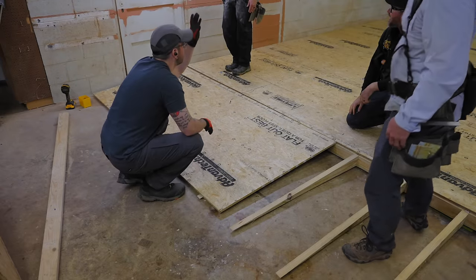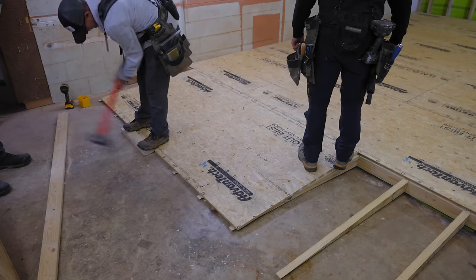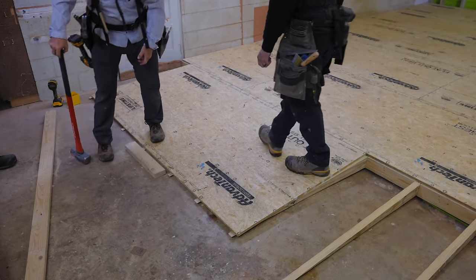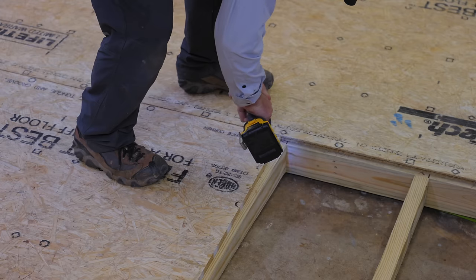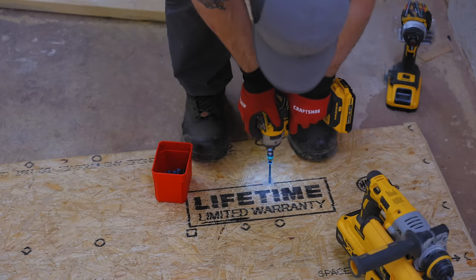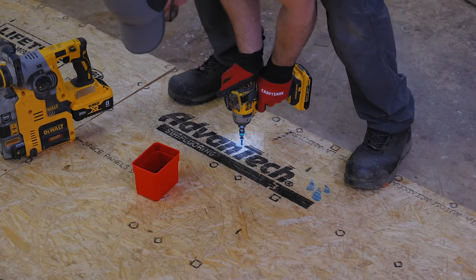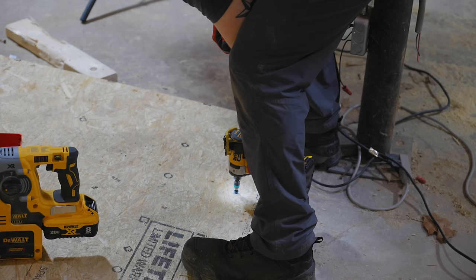We tested the transition between the ramp and platform panels and the tongue and groove seated fine with the panel angled, giving a super smooth transition. I decided to forego subfloor adhesive and use screws on the ramp panels in case I ever need to change things up. I attached the bottom edge to the slab using concrete anchors — though I ran out and could only install them roughly every three feet — and with that the platform and ramp were officially built.